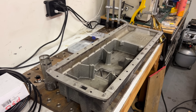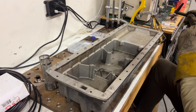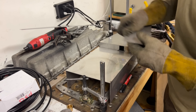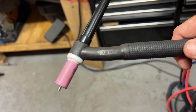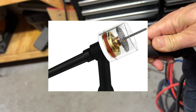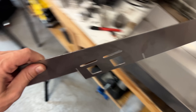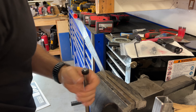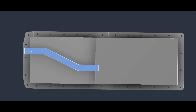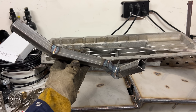Since I'm cheap and I got the flange in six separate pieces, we need to weld them together. The easiest way to do that is to bolt them up to the old oil pan. I did need to be a little careful with the weld since I don't want to warp or melt the aluminum pan, but the welds were small, so no problem. We'll need to clamp it down to a flat surface for the final weld, but first I need to weld up the sheets to make a pan. This junction makes for mediocre welds, and this type of torch setup is not great for stainless — you usually want a more even flow of gas over a larger area. The tube needs that joggle in it. I was originally going to heat it up with a torch and bend it, but I knew it would be easier to just cut it and weld it. I cut out some metal for the corners, welded it all up, and welded it into the pan.